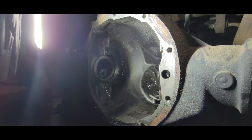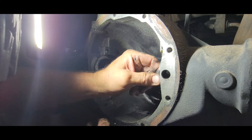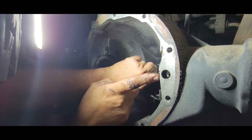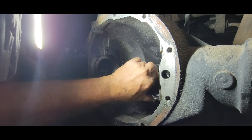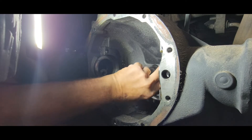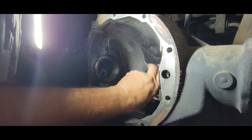What you can see now is there's a shim right here — that's the shim that was on there from the factory. We're going to leave everything where it's at, and if we need to change that we can, but we want to keep track of what's what. If a shim falls out, you need to know what side it came from. I'm also feeling this gear and feeling the bearings to see if they're fried or not — and they're not. The bearings on this are just absolutely perfect.